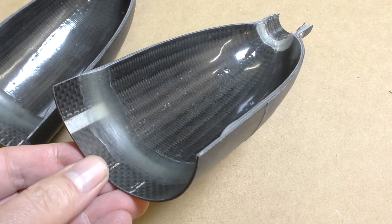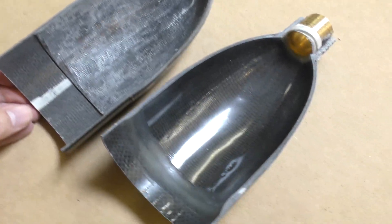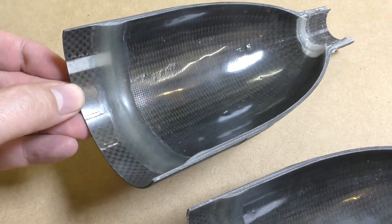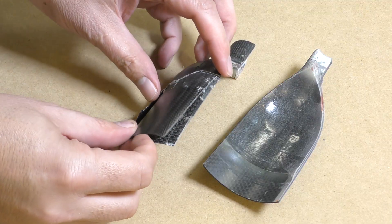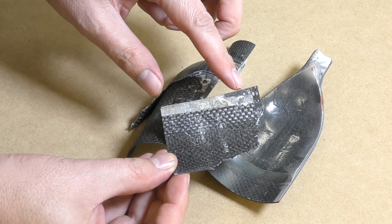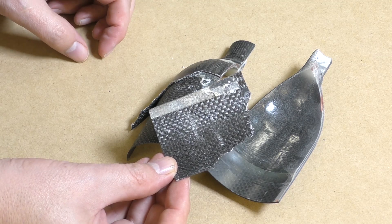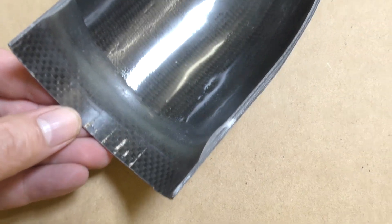Here is the nozzle end — it also looks very good and clean, with no cracks or damage. Here is the previous one for comparison — you can also see the edge joint is a lot better. The tape was also scraped away from the end of this one and we don't see any sign of leakage; perhaps the pressure never made it into the tape at this end of the tube. We cut the end cap again, this time through the tape itself, and we can see that although I scraped away the visible part of the tape, I didn't remove the part of the tape underneath the carbon fibre that the tape was holding down. This means there was still a direct path to the outside along the tape.